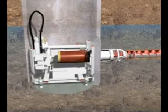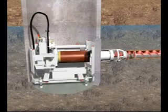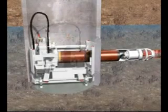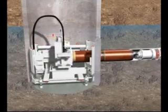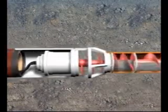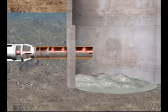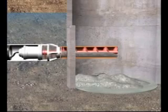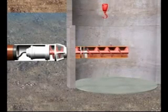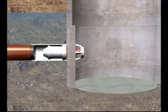If a sewer with a bigger outer diameter is to be installed, a second reamer enlargement is used for the third step. In the launch shaft, a reamer with a direct drive unit is coupled to the last casing. The product pipes are pushed in directly behind the reamer. The drive unit in the reamer is powered through hydraulic lines that are laid through the following product pipes. The ground is excavated with a special cutting head and transported through the steel casing to the reception shaft by the anti-clockwise rotation of the augers. The excavated spoil is removed from the reception shaft. When the reamer reaches the reception shaft, the sewer is complete.